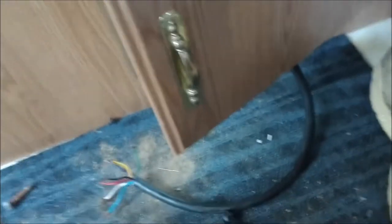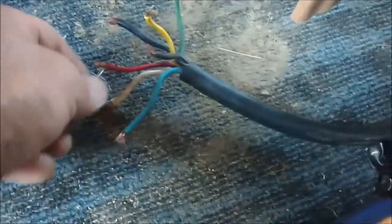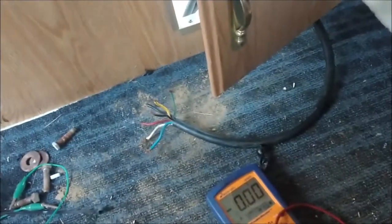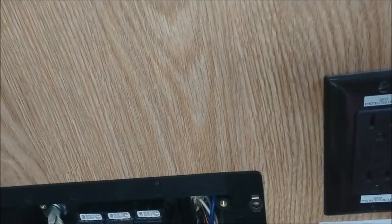I want to check that I should have 12 volts down to the trailer plug. There's my voltage for the trailer plug - I've got to get that put back on. Everything looks good - I don't see any lights on, no short circuits. I don't have the AC power on yet, but that would be the next step - plug in the AC and make sure I don't fry something. The camper is plugged in to power in the garage. I'm pulling 12.848 volts DC out of the battery. I'm about to turn on the main 30 amp breaker.